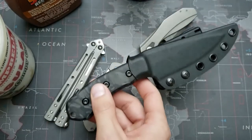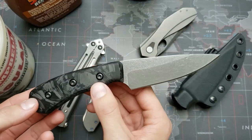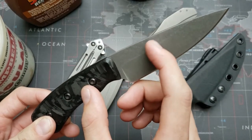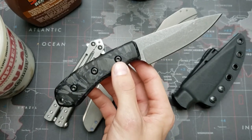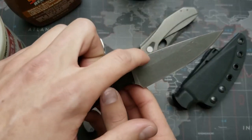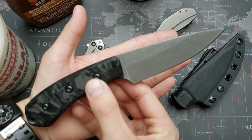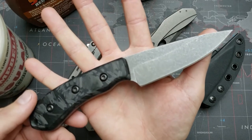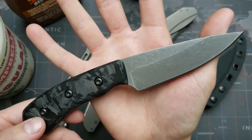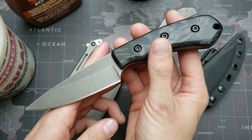Here's another one — this is a knife that I made, medium duty. It had a two-tone blade; I'd left the flat satin and I liked the full acid stonewash look. Also, you can kind of see it in this light but in person you can't even see it — this little mark here. When I sent it to Peters Heat Treat, they tried to straighten the blade which must have warped during the quench. They heated up really hot at the spine and it left a ring there that didn't really go away. I had trouble finishing it before with just the acid, but what I found is that with the stonewash it hides those marks so much better. I kind of liked the look of it with the shred carbon fiber — it looks super badass.